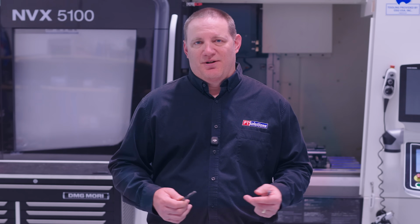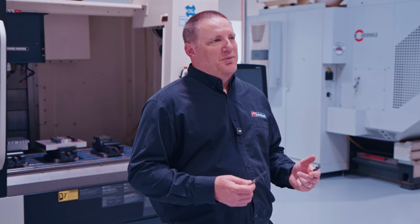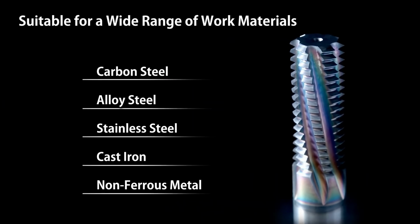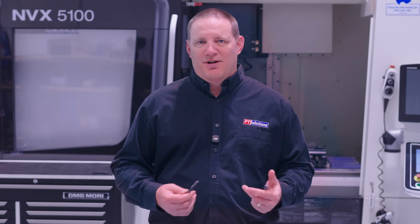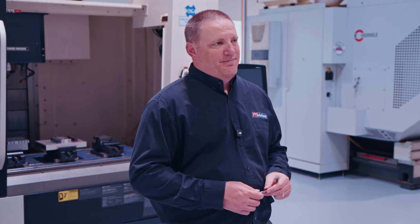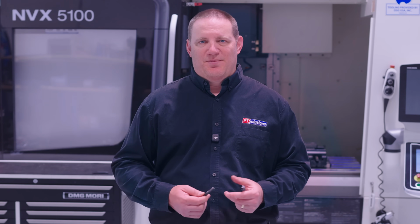Let's talk about materials, because this is where the decision often gets made. In aluminum and mild steels, tapping is usually faster and cheaper. In stainless, exotic alloys, or hardened materials, thread milling is a darn good option. Thread milling generates lower torque, better heat control, and avoids the all-or-nothing failure mode of taps. That's why hard threading is almost always done with thread mills, not taps.